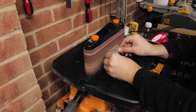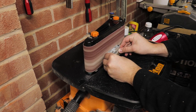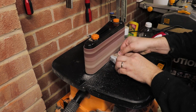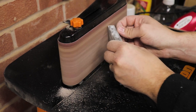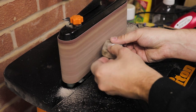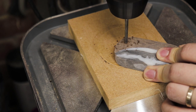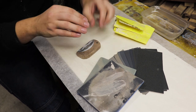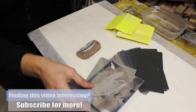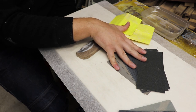So I've taken it out of the form and now it's time to sort it out a little bit on the sander. We're going to start with normal sandpaper from grit 200 right up to 400, then we're going to do some wet sanding with the pads going right up to 1200 grit, and then we're going to move on to the micro mesh that goes up to 12,000.